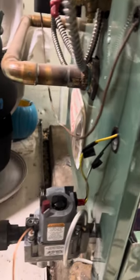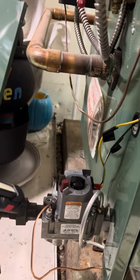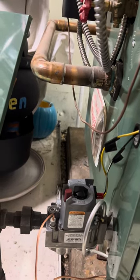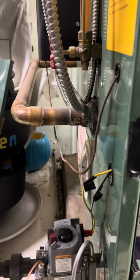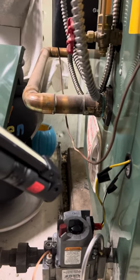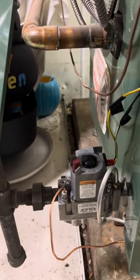So the 24-volt solenoid in here was weak, so it was just chattering like that. Bubble test — you basically just take some bubbles, throw it all over all the joints, and make sure it's not making any extra bubbles. You can get a gas sniffer as well. This is working fine now. So if you get something that's buzzing, check what I did — I just shaved it off a little bit and took a 24-volt reading. If it doesn't get 24 volts, it might chatter because it doesn't have enough voltage to close that solenoid. It had 24 volts, no problem, and it was still making a noise — bad solenoid. And you can't change it unless you change the whole thing. Like and subscribe, and I'll see you guys next time.